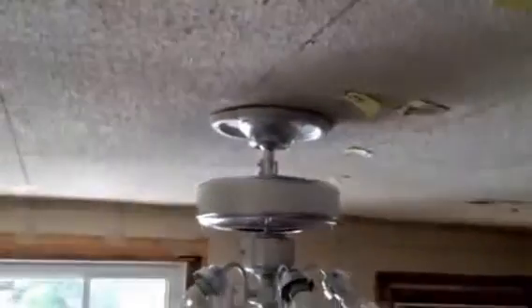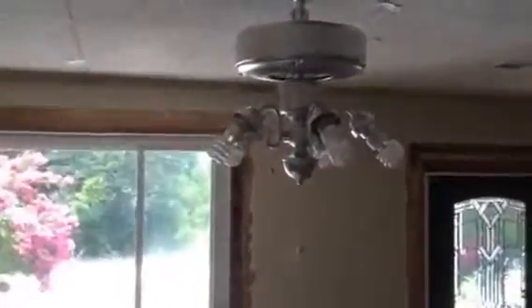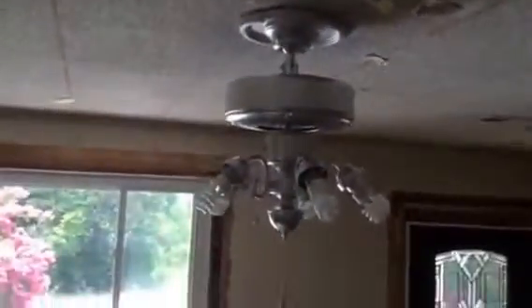I'll keep you posted. If you have any questions please post them — it is confusing, and this is my second full ceiling doing this. It worked out great the first time. If you do have light fixtures where you're going to have to cut a hole, what you do is plumb-bob the floor. You put your plumb bob hanging from the light fixture — it's just a weight with a string. Drop it to the floor and mark the floor. When you get your drywall up, you'll know exactly where your hole is by putting the plumb bob centered right under the hole.